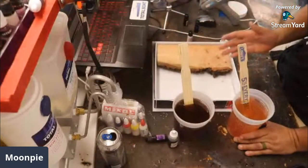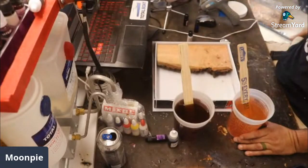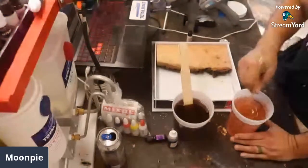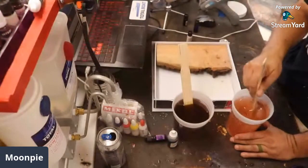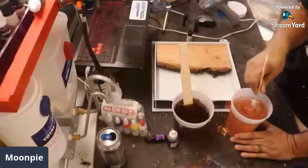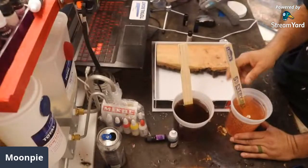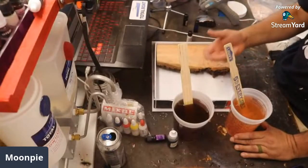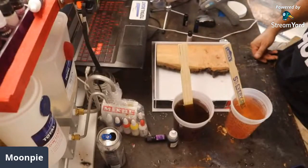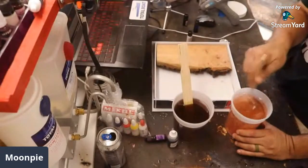I put them in the oven at 220 degrees, they were in there for four or five hours last night. I put them on again this morning about two hours ago and they'll bake for four or five more hours. I'll turn them off, then later on tonight I'll put them back on — I do that for about three or four days and then it's usually dry enough. But when you do that, your moisture meter will not work on the wood — I guess when you heat the wood up you change it chemically.